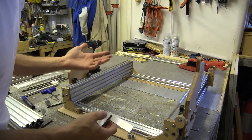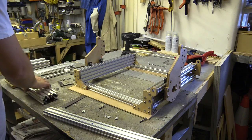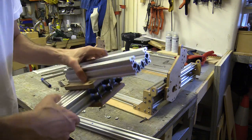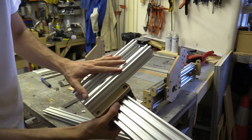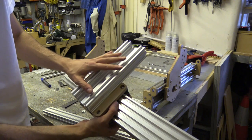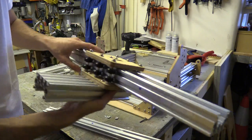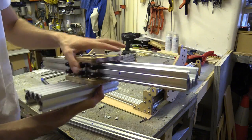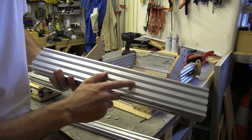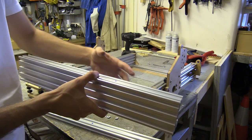So it's the plates, it might be the wheels. I'm really confused. I was hoping it would pull itself. Okay, I've adjusted the wheels a little bit and they're still the same. So I think what I'm going to do is when I go to fit the spindle on, I need to make sure that this Z-axis C-beam is square to the wasteboard, and to do that I need to be able to access all the machine screws which hold it in place, and there's two which happen to be right behind the C-beam. So I'm just going to drill a small hole somewhere along the middle where I can adjust my machine screw.